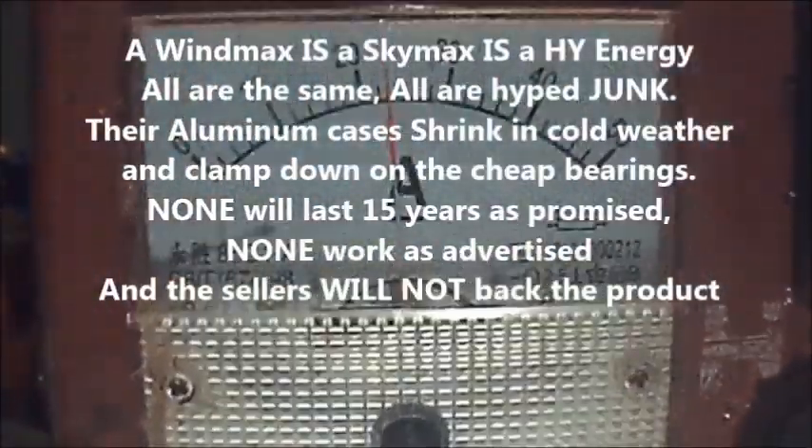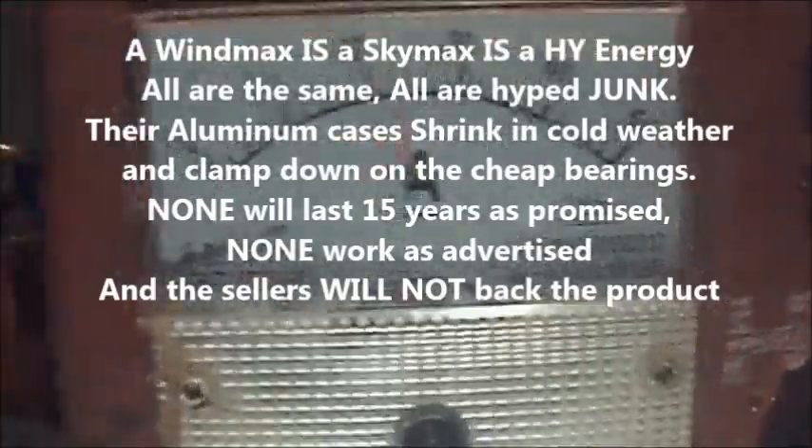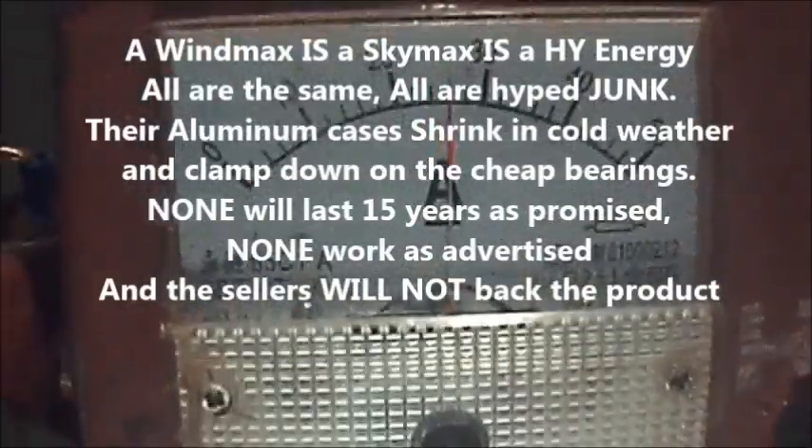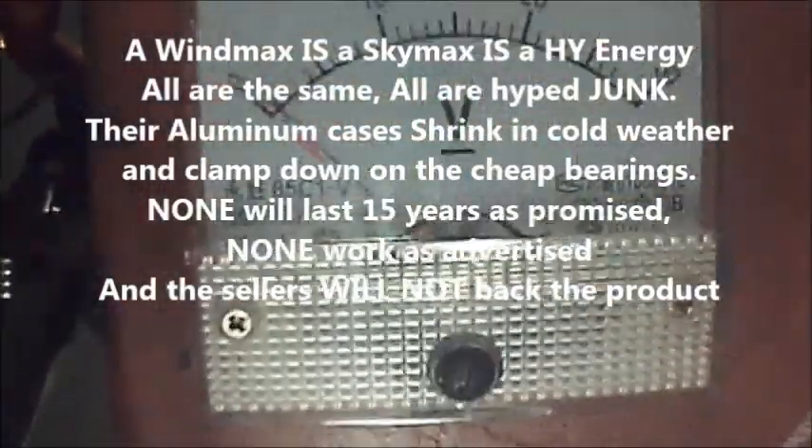The inversion is pretty accurate. If I leave it on there, you might get a reading of the peak. The date and time is 11:10 PM, 12/11/14. Hopefully it'll come back up — it just dropped a little bit. Wind speed's 25, 26 miles per hour, and it's been that way. There we go, 27.3. The Windmax, Skymax, HYE renewables — whatever they want to call it — that's what it does in cooler temperatures.